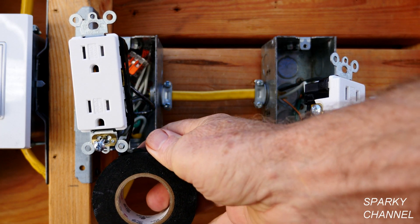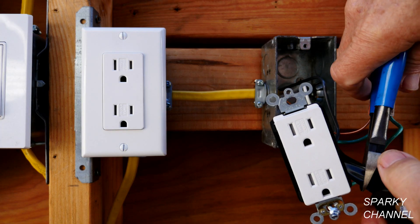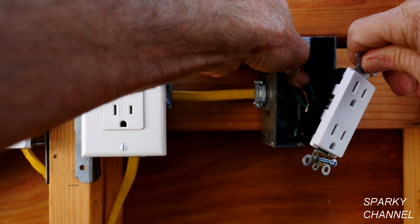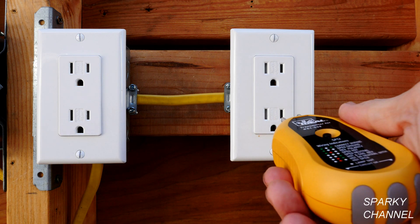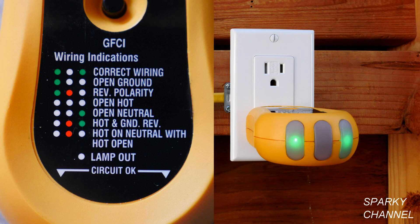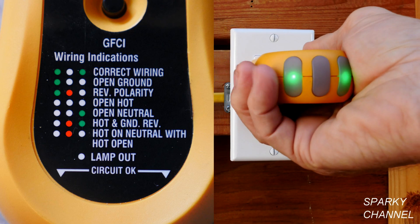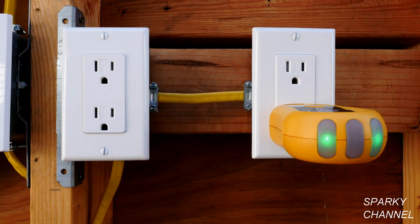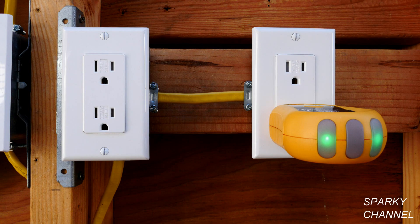I'll put a couple wraps of black electrician's tape around the receptacle for safety, make accordion bends in the wires, and press it back in. Then tighten down the receptacle and put the wall plate back on. With the circuit breaker back on, I'm plugging the outlet tester into the original receptacle that had the problem — and we have two green lights indicating correct wiring. It works on both parts of that outlet and on the first upstream outlet as well. So that's how you fix a receptacle that isn't working due to open neutral — the problem was not in that box but in the next upstream box, where there was a loose, cut, or damaged neutral wire.